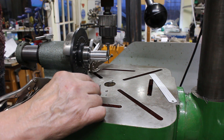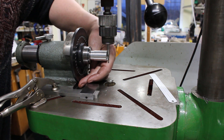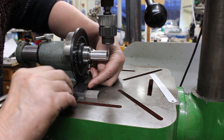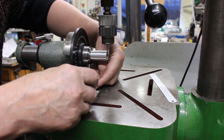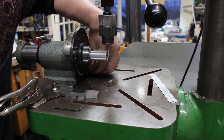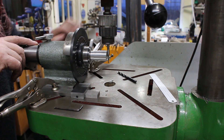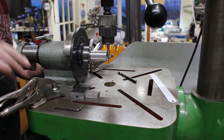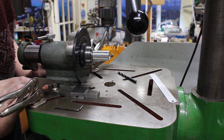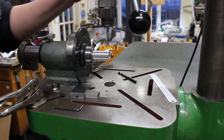So this is where my little gadget comes in handy. I just put a 6mm drill shank in there, push the block up against it, and tighten with an allen key. Now remove the drill — so we've got a gap of 6mm. Unclamp the indexer, move it forward, take up the end mill, move it forward. Okay clamp it down on the other side — so we should now be in the right position.